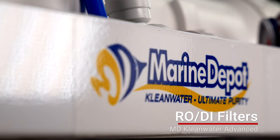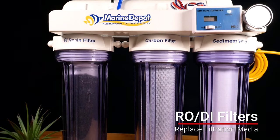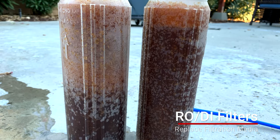For maintenance, if you have a system with a flush valve it will flush out your RO membrane automatically. The other maintenance is replacing the filter elements. Once the sediment filter starts turning dark, just replace it — sediment filters are super cheap. For DI resin, I strongly recommend buying color-changing DI resin so you can tell just by looking at it when it needs replacement. How often depends on your tap water quality — chlorines, chloramines, mineral content — and how many gallons you're making.